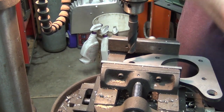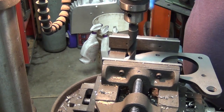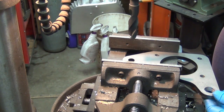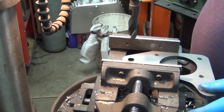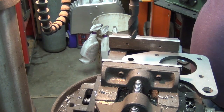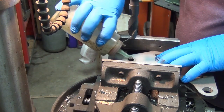I think I'll slow that down a little more when I'm doing them all - I'll pay more attention to what it takes to make it faster production-wise. I'll put a little oil on it this time. If I could drill them dry that would be great because then I don't have to clean up the oil before welding, but we'll try it with a little oil on there.